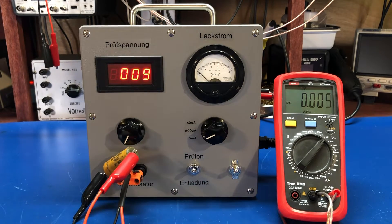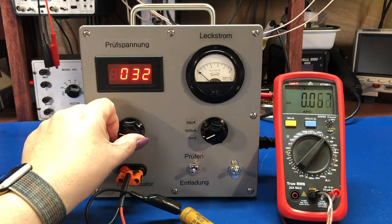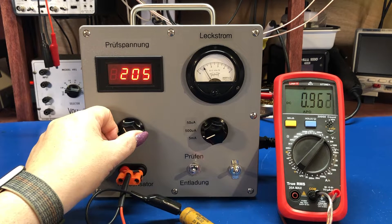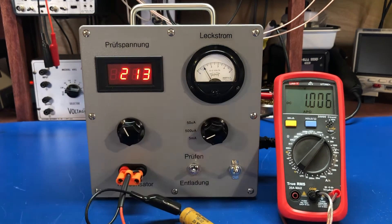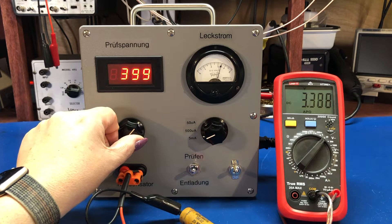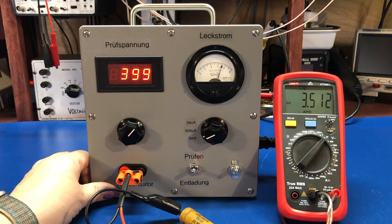Put it on test, and we bring up the voltage. Remember, this is rated at 400 volts. So up at 200 volts, we've already got a milliamp of leakage. If we get it up here, you can see we're reading one milliamp on the scale — one volt over here, so that's one volt per milliamp. Keep going — 300 volts, 400 volts — we've got about three and a half milliamps of leakage, which is a lot.